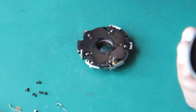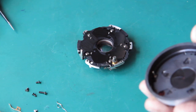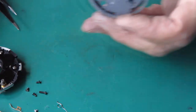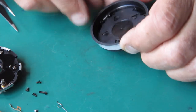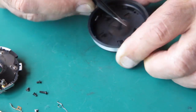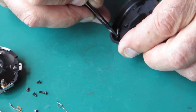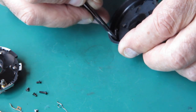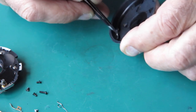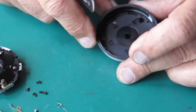That was not convenient. Right, so here's our shutter blades off. The case is split. The mechanism plate here has our shutter blades and all the other stuff on it. This here is the diaphragm mechanism. That cover plate is held down with 2 screws. There's a return spring here which acts to close the diaphragm. It's a bit sticky in its action. Will certainly benefit from cleaning.